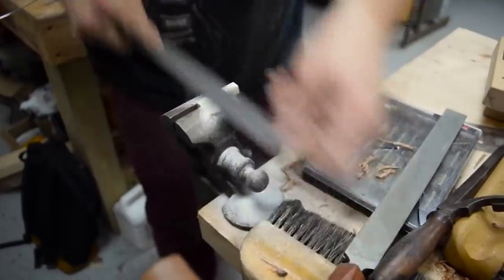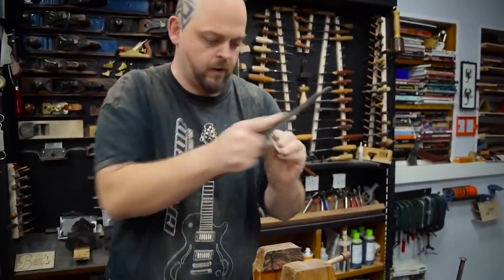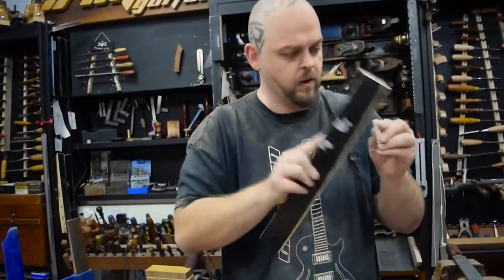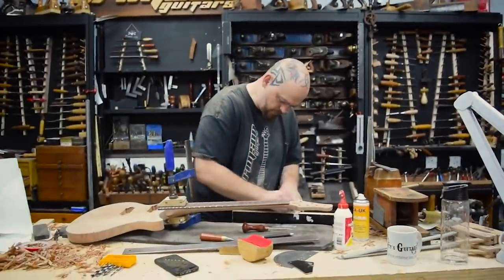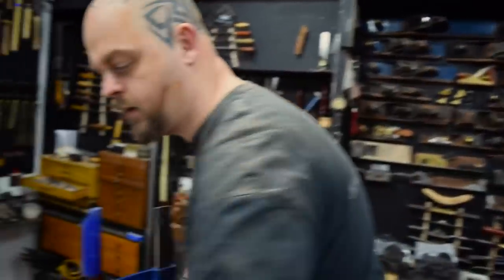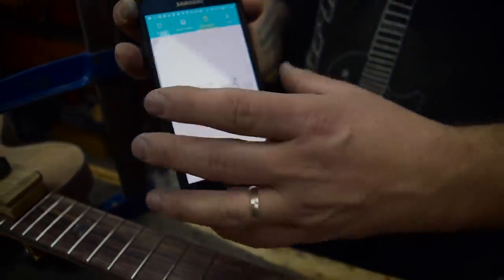Two hours left to finish building a guitar. Don't do this at home, folks. It's not good for the heart — I said heart, I meant lungs. Here I'm rounding the ends of the nut off, where your hand will be touching it the most. The nut should be superglued down in place. Superglue is very strong, but with a good sharp tap with a screwdriver or a hammer, that will delaminate and come away quite easily. So we stand at seven hours, three minutes, 50 seconds. I have failed the six hour guitar test, but the ten hour guitar — did I say ten? That's what we've been saying since the beginning.